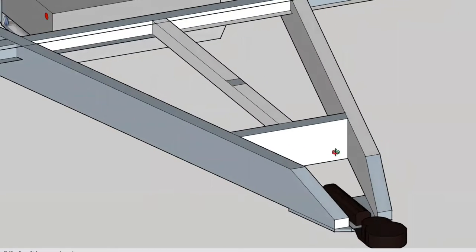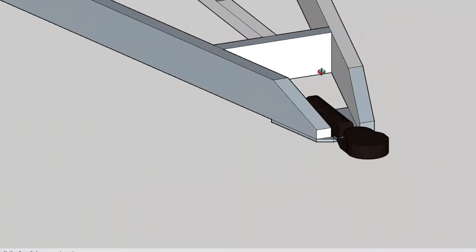I'm going to do the hitch plate section where the chassis rails are cut down at an angle, like in the SketchUp picture here. Got the whole trailer still assembled with straps all together to try and square it all up and make sure everything's right. Can't believe how perfectly everything turned out in terms of the length and where the chassis rails end up at the hitch. Distance apart there, and the angles are all perfect, which is uncanny for me. Then I'm going to do the rear section of the trailer as well, where the rear chassis crossmember joins into the chassis rails. So that's today.